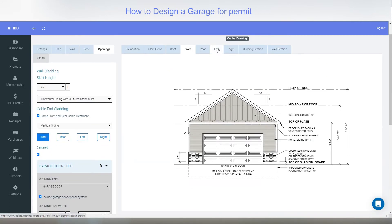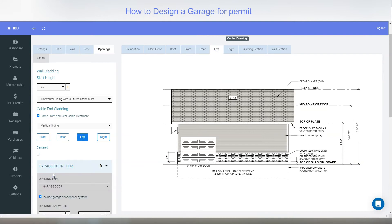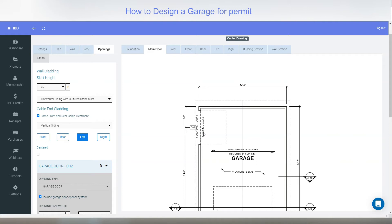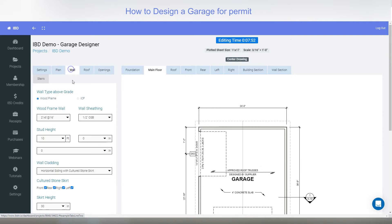Switching to the left side, I'll put in a garage door there as well. In the plan view you can see it's put in three 2x12s with double jacks because there's a lot more load on the eaves side where the roof is sitting. If I increase that to 12 feet you can see it automatically goes to LVL. It'll pick regular lumber up to three plies if it can, then go to LVLs, and then to a steel beam if needed.